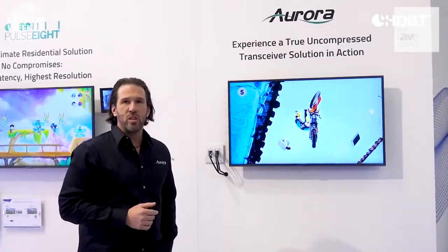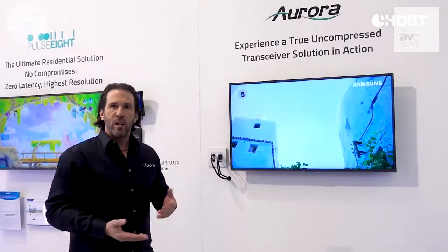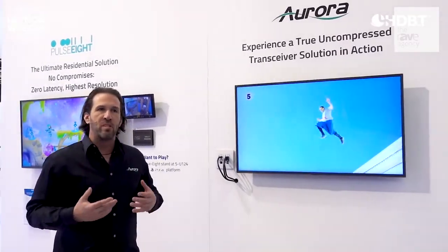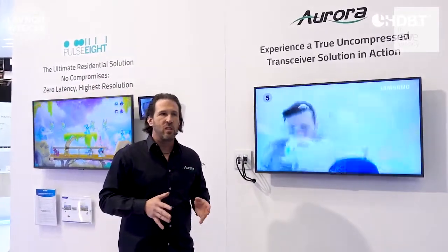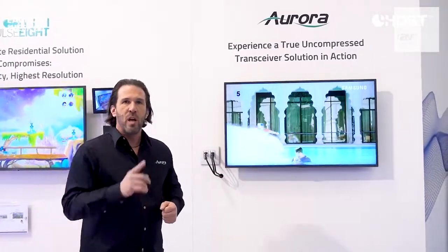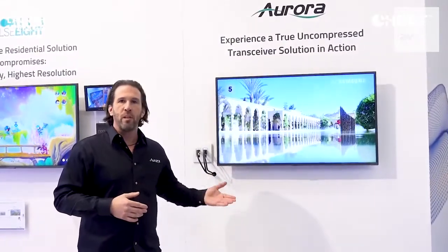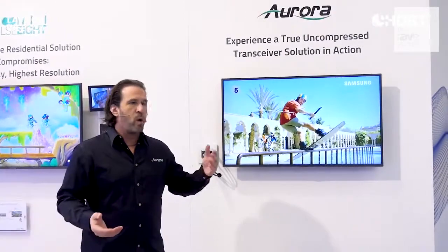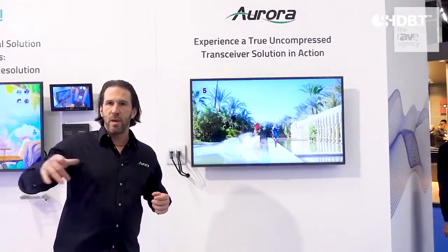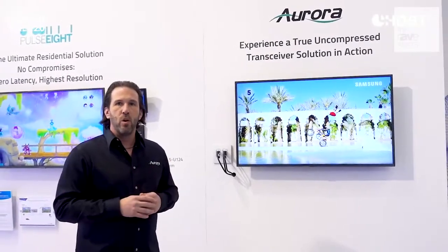Now you have yourself the additional image coming off of input 2, and right now we're showing this being used in a receive mode. If I changed it, we could run it in a transmitter mode and then do the opposite of it, which opens up a lot of new capabilities, a lot of features, but the most important thing that it does, it actually lowers the SKU count, because instead of having transmitter wall plates, receiver wall plates, now it's only 1 SKU. And it also opens up other possibilities in rooms. You can have a wall plate in the front of the room, wall plate in the back of the room, make one to be the encoder with a command, make the other to be a decoder, and now they can actually be an extender within the room, or make them both encoders and feed them back to a switch. So it opens up a lot of new possibilities.